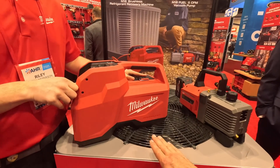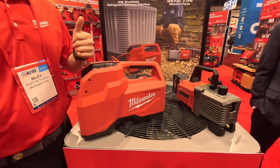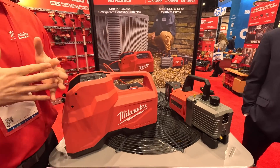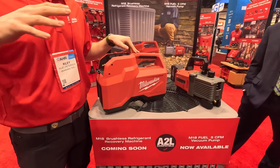Okay, but no estimate on run time? It just depends on what you're doing because there's a lot of variability in temperature and how long the line set is. So we're giving system size instead of specific run time, but what we can tell you is that for a 5-ton 16 SEER system it takes about 15 minutes.